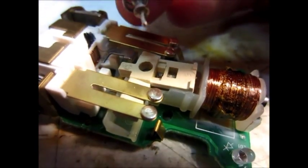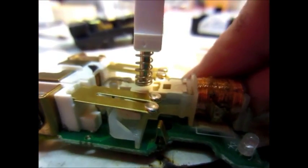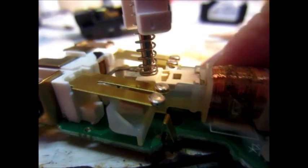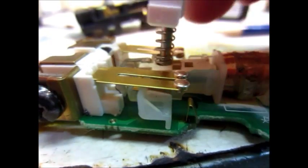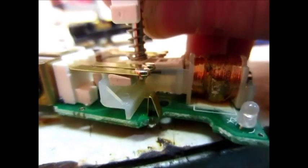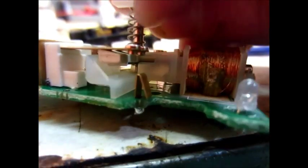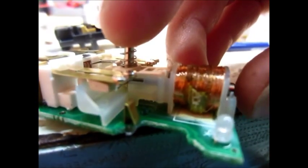There's a little mechanism - there's this piece with a groove and a knobby part - and when this button is pressed in, there's a little switch down in there that closes right now. When that closes, you're pushing the reset button, that closes and activates the electromagnet. I'm activating the electromagnet right now - there we go - and now the contacts are up, so now there's power coming out.